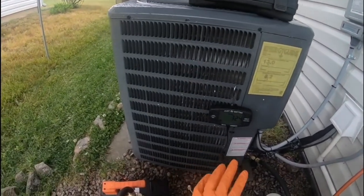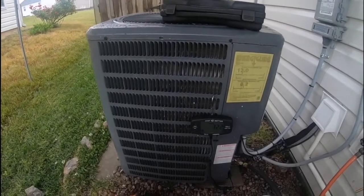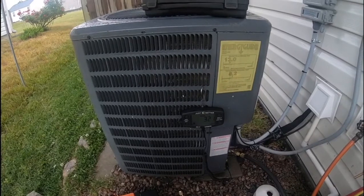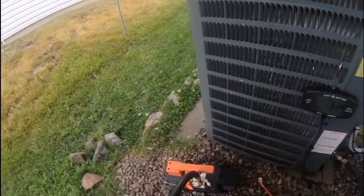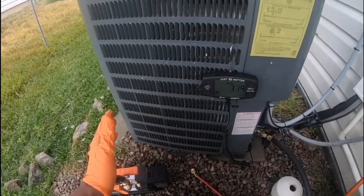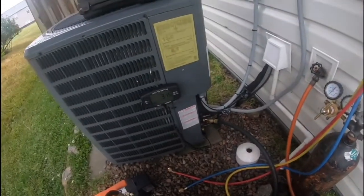Wow, that is mind-blowing. I only wanted to bring it down to 500 microns, and it's already at 323. I have to go get my tool to release the refrigerant and get this system started. I'm done pulling the vacuum — I'm happy with 500 and I'm down to 319, 318. In less than 15 minutes I'm down to 315 microns. Less than 15 minutes — wow.